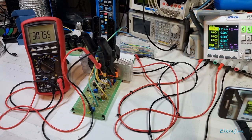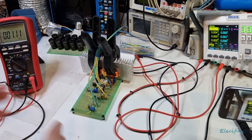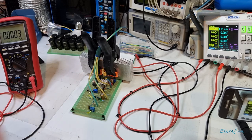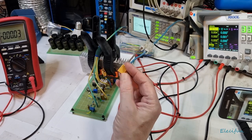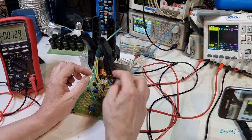You can do this if you use a transformer and capacitors. This is my speaker output, by the way — these two wires must never touch together because if they do, it'll bust up the transistors, and that won't be any good at all. We know there's no big issue there. Now I've used XT60 connectors — I've got quite a few of those from the old drone stuff. Let me just switch this up for a minute and make this connection.